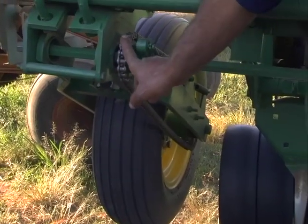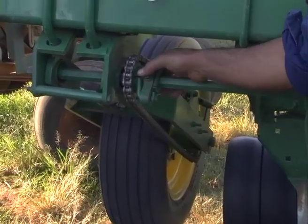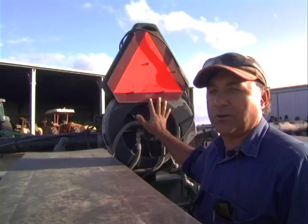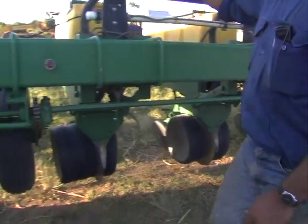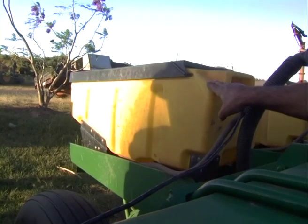It's driven by both wheels on both ends, and it's got a little slip here so if one's beating the other around corners, that just slips around. It's a vacuum planter so we have a vacuum up here. For peanuts we work on about eight to ten vacuum depending on the size of the seed. The beauty of this is it's got the larger boxes, so especially for soybeans this will go a heck of a long way.